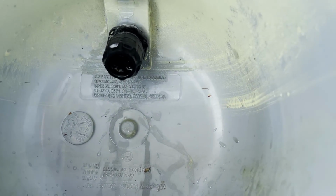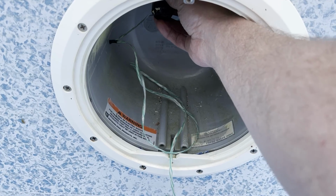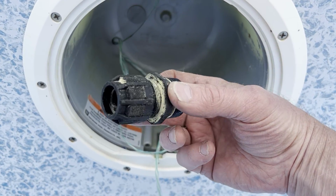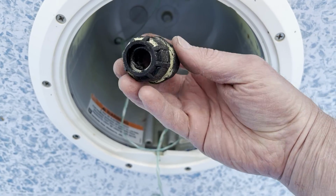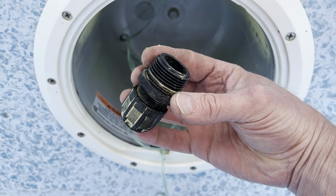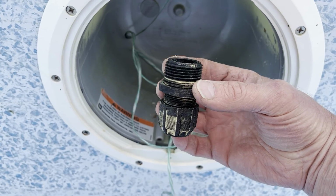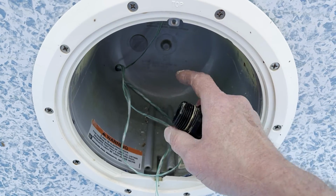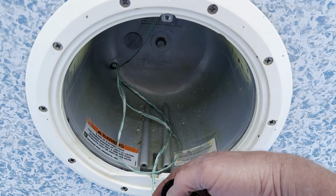There's a good view of the cord connector for the light. I want to tell you about a better thing to do with the lighting. Use a cord grip in there with a 1-inch thread, and then I think this is like a 1/2-inch cord, something like that. I'll try to put a link in the description, but use this instead of the putty and all that other crap that they do in there, because it's hard to get that stuff out.